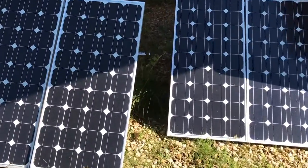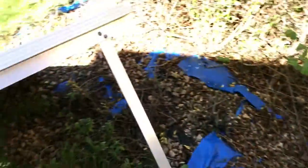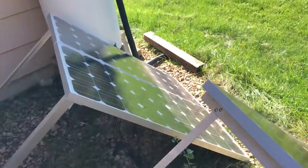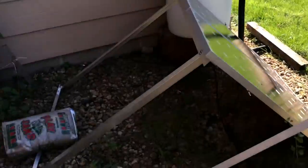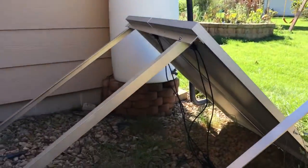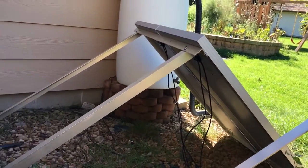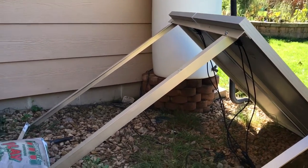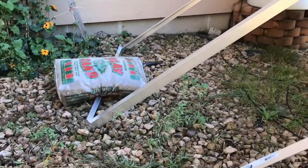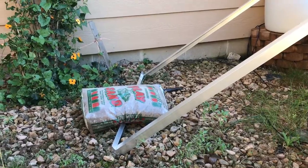Let's take a look at what I did behind the panels. I have my panels situated in a location where they get sun around midday and late day, so even here in the morning I'm getting only partial sun. What I did is I got some angle aluminum from my local home store, attached a bar piece up at the top at a pretty good angle, and put two legs of angle aluminum down to the ground, plus one more crossbar.